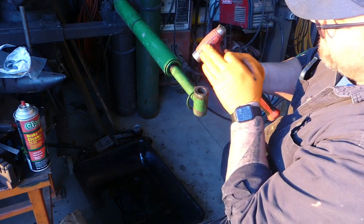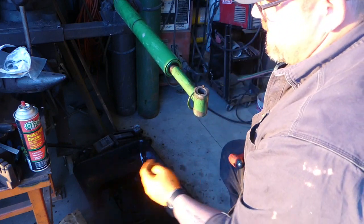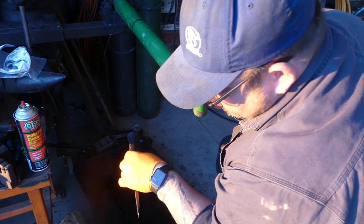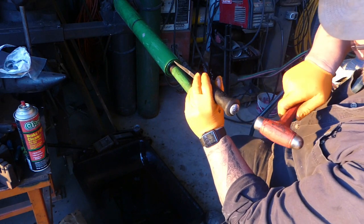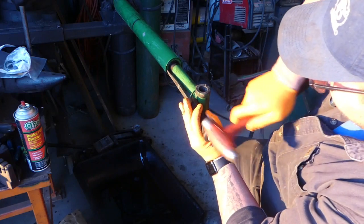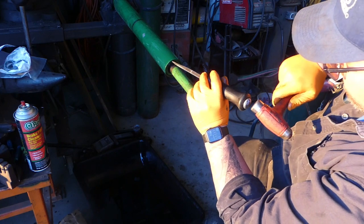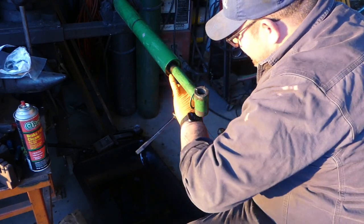I really like these Snap-on hammers with the rubber that protrudes, because now you're just having your rubber stick out on there. This one here was a replacement, but this is a pretty cool, it's a MPBS-12A. It's just a big striking screwdriver. Works pretty good. We're gonna hit here. And we're gonna keep going in until we see a little notch. Still don't see the notch. Okay, I can start to see a little bit of the notch.